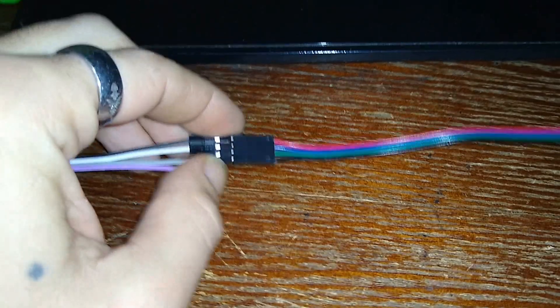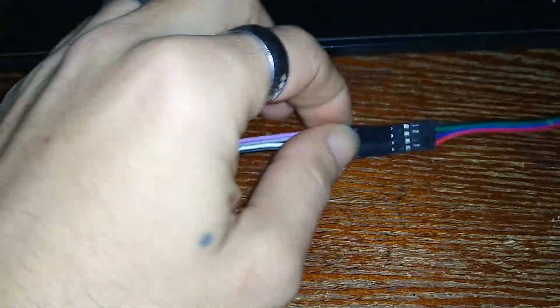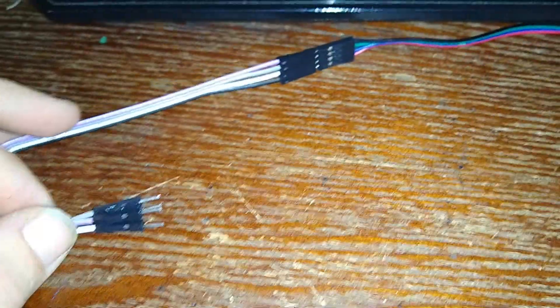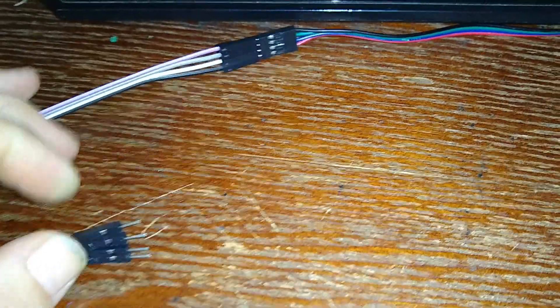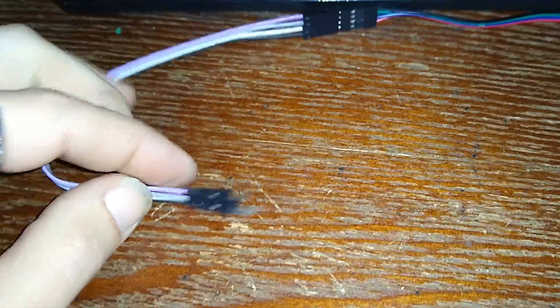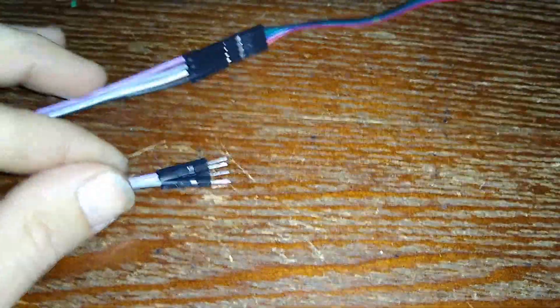One of the things you'll need for this mod is a longer cord for the extruder motor. I'm not going to disconnect mine. Instead, I'm grabbing another cord and some male-to-male jumpers to extend it. That way I don't have to open my CPU to rewire the motor, and if I decide this isn't working, I can just unplug the extension and go back quickly. It's a plug-and-play hack.